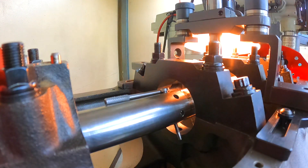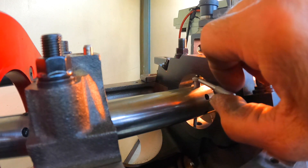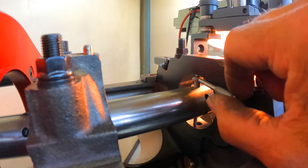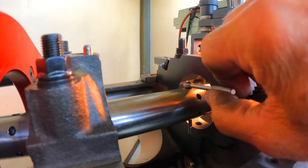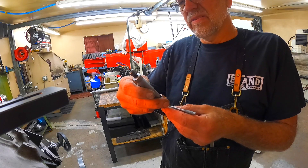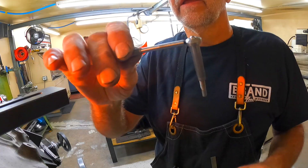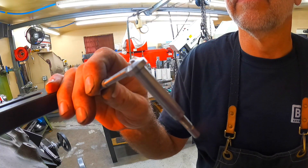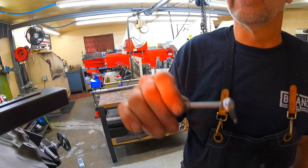That ring goes in — slide it inside, release the plunger, tighten the little handle up, and slide it out. And actually mark it — see what size our hole is. Pretty nice little tool. Check each one before you pull it off. And the next step is to hit it with the line hone and finish up.